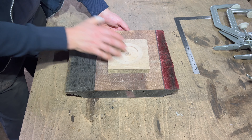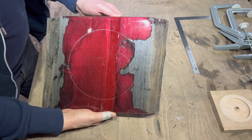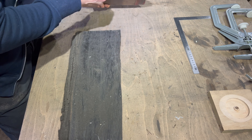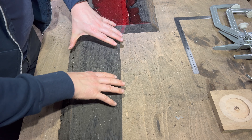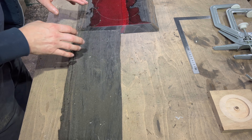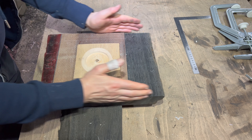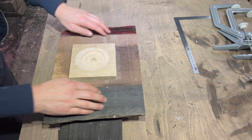I thought I'd just cut the edges off that were on there so I could trial the attachments — and see how well they're squared up, which is very well I might add, albeit this one's that much higher. I'll take that down a little bit further later, and maybe just bring this up a little bit with simply some sheets of paper. When I take this off on the planer after I've turned the bowl, I'm going to run it that way through the planer. My planer's not big enough to run it the other way, which is the way it should go, so I've got to make sure I don't hit this bit otherwise it'll just chew it up. I'll just take this flat enough — we're talking millimeters.